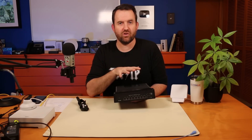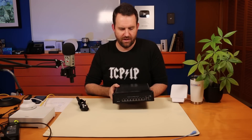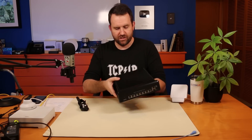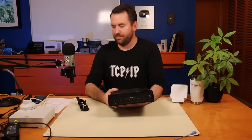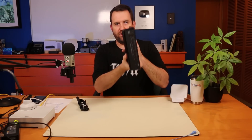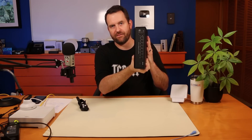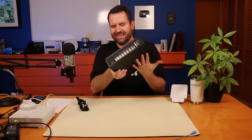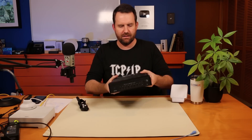We are very fond of the Netonix switches — those are ruggedized switches we use in a lot of our outdoor wireless ISP deployments — and you could certainly use this in place of those. This switch is completely fanless and plenum rated. It can be installed horizontally or vertically in a wall, so anywhere you'd have to run plenum cable, you can also have this switch. It's a die-cast aluminum enclosure, and this thing is easily around eight and a half pounds.